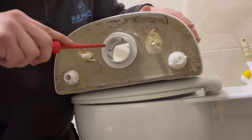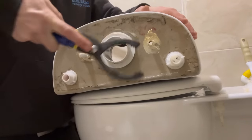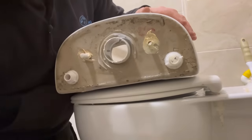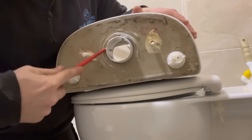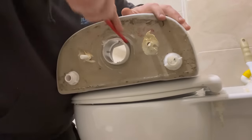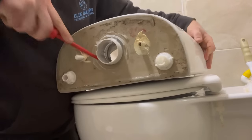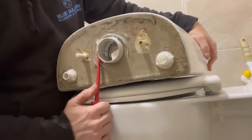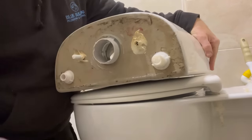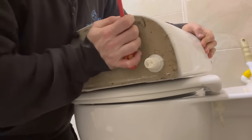I'm pretty sure the last plumber used a whole tube of silicone on this — it was ridiculous. The amount of silicone they used, I just couldn't get it out. It was properly stuck in there and I'm swearing in my head at this point. So I've got to try and break that silicone off — I'm whacking it, stabbing it, just doing anything. It's 6 o'clock at night, this was my last job of the day, it should have been easy, it should have been nice and straightforward. Look at the amount of silicone coming out of there — just ridiculous, there's no need to use silicone there. Some people might disagree with me but I don't use silicone. Just jabbing the screwdriver in there trying to break it off and get this siphon out. All this silicone probably added another half hour onto my time.